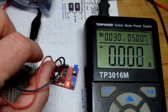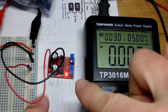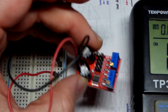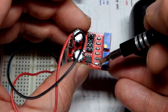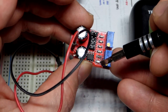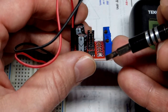The timing shown is straight out of the bag — I haven't adjusted anything yet. I wanted to show that we can adjust the frequency with the trimmer potentiometers. It looks like it's at the slowest range right now. One trim pot controls how long the output is high and the other controls how long it is low. It looks like about one hertz — the LED turns on and off about once a second.